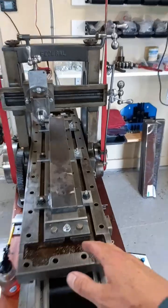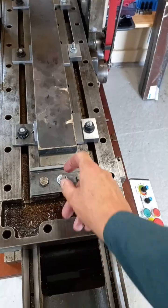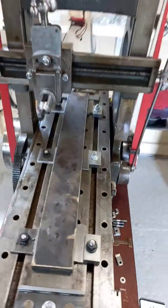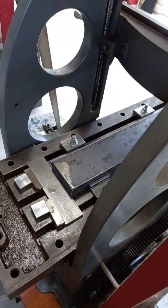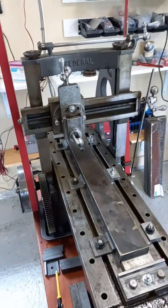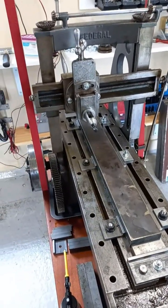You can see what I've done: I've fastened it down — I've made a clamp, two dowels here, a T-nut there, and the stud — and that's all secure. These are secure down this side; there are taper wedges down here and around the back driving it forward, and two taper wedges in here pushing it forward, so it should be pretty secure. We'll see how we go with this — I've no idea how it's going to perform yet. We'll get a tool fitted in, get everything sorted out ready, lubricate everything up, and see how it goes.